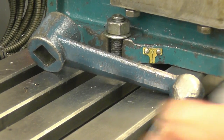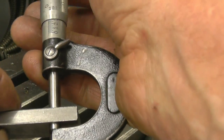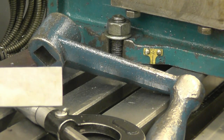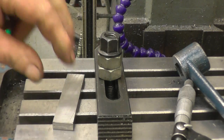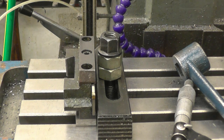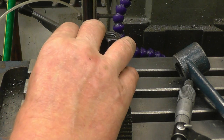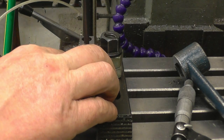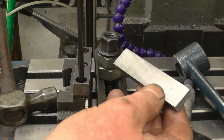Very nice. I've taken the rags off the sides - that's three hundredths, three hundredths there, slightly under three hundredths. I'm happy with that, it's now three hundredths thick. I need to transfer those two outer holes onto there - it's going to be held on with two 5 mil bolts. Easiest way to do it is with a transfer punch. Put them against there so they're nicely lined up. Five mil transfer punch, just gently - one, two. That's the two holes marked off. You could measure them and mark them out, but a transfer punch transfers them - it can't be anything other than right.